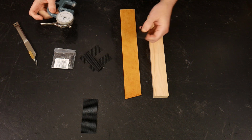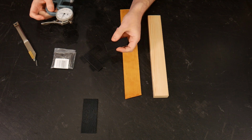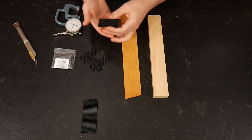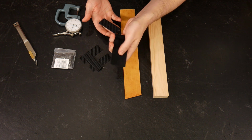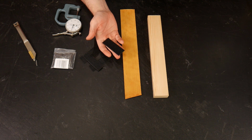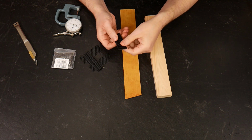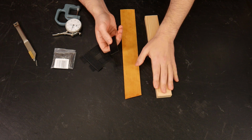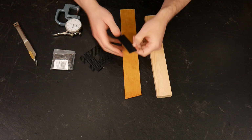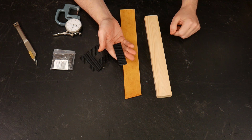The rubber is what I'm going to use to get this to stick to the table. So this is simply just rubber flooring. This is in fact some offcuts from rubber flooring that I use to line my workshop, my other workshop where I do most of my woodworking now. But this is ribbed, and that's going to be good for two things. One, gripping. And number two, we can bury some panel pins, these little things here. We can bury some of those in between so that they're below the surface.